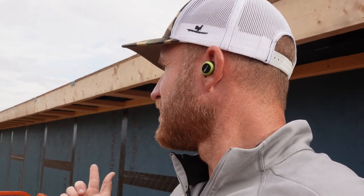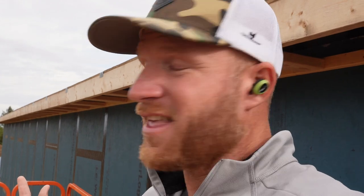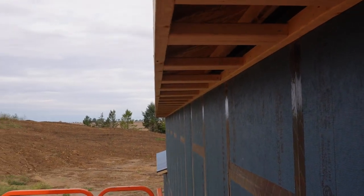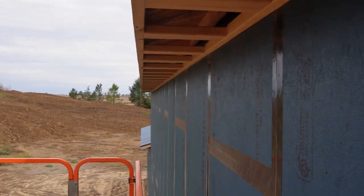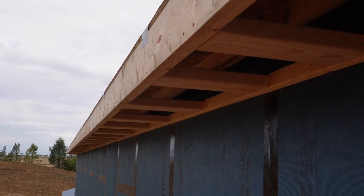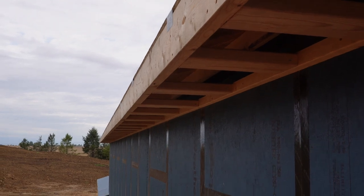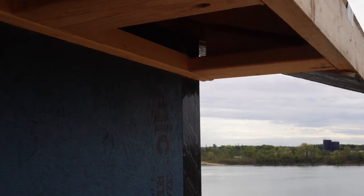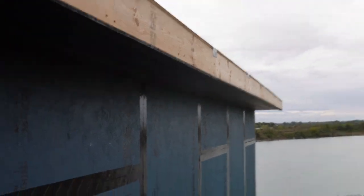So what do we got here? I've got 16 on that and then these were 15 and a half. Greg is saying that right here it measures 16 inches but these first two trusses must have been a little bit bigger than the end truss. Nobody's going to notice that, but what we need to do is cut our soffit so it fits - if we cut it at 16 where these two trusses are it would stick out past the fascia. So we'll cut it for the 15.5-inch trusses, and over here on this end it'll just have a bigger gap at the wall which gets covered with our siding and trims. Always think about how to make it look good, not necessarily cut things as they should be, because you never get perfect materials.